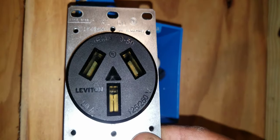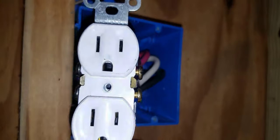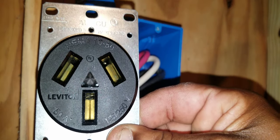In this video we will specifically be dealing with installing the 50-amp 3-wire range outlet. If you have a gas stove or gas range, this video doesn't apply to you. These are 240-volt outlets. If you have a residential gas stove or range, you don't need a 240-volt outlet — you just need a regular 120-volt outlet. So now let's get started.